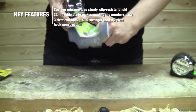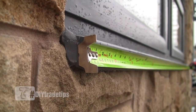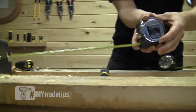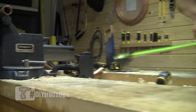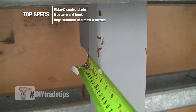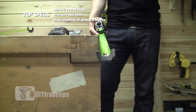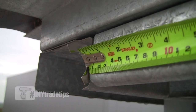As soon as you pull out the tape blade, first thing you notice is the end hook — it's about 50% bigger than a standard end hook. You've got extra points of attachment: as well as the traditional blade and traditional point of attachment, you've also got a top hook so you can measure from underneath the surface, but you've also got side hooks. Side hooks are brilliant because if you're measuring something side on with a normal tape, as you turn it on to the side the tape normally breaks. With side hooks, you can grab from the left or from the right — so if you're measuring girders, a wall, or a separate point of attachment, it gives you extra versatility.